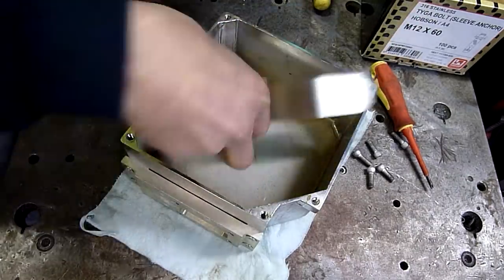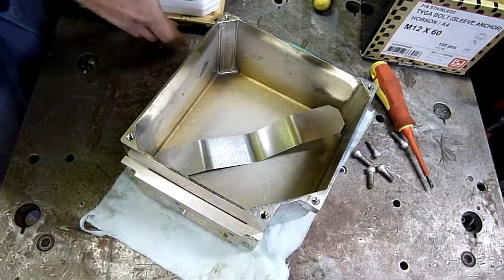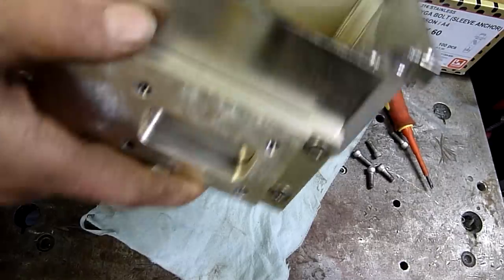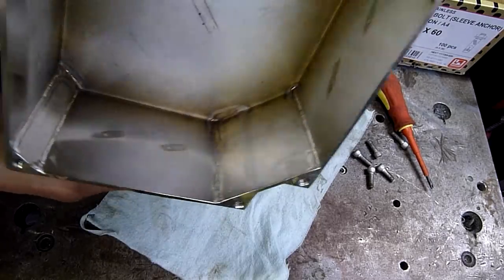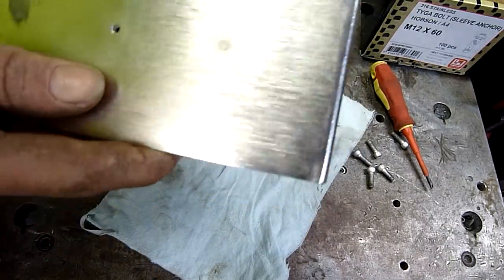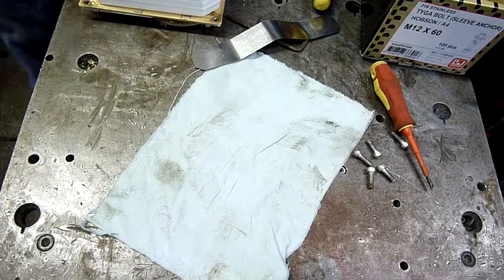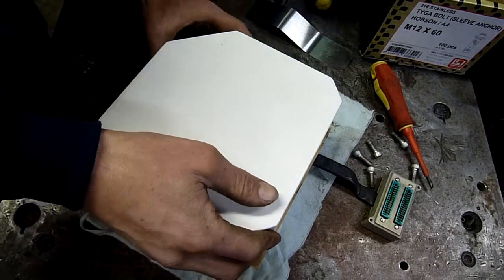That's fireproofing. You can see the shield's back on the mechanicals. Look at that - pretty sure that's stainless. It looks like it's electro-polished stainless. You run direct current through it in a certain solution and it polishes it like that. Direct current needs line of sight - you can see where it's cloudy where the DC couldn't reach. Most of the stainless stuff I make at work gets that treatment. That's an outer impact skin shell.